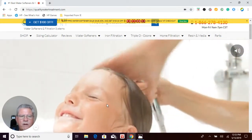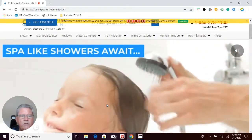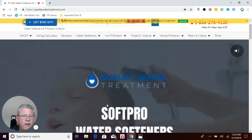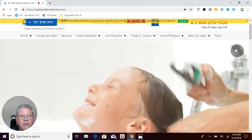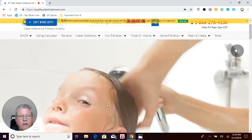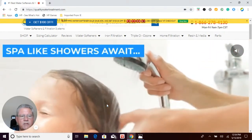If you're on your own private well, because most well water has some iron in it, we recommend that you use pellets made for well water. They have an iron-out component in them — a mild acid powder built into the salt pellets — which helps strip the iron off the resin bed, helping the softener perform better and helping the resin last longer.